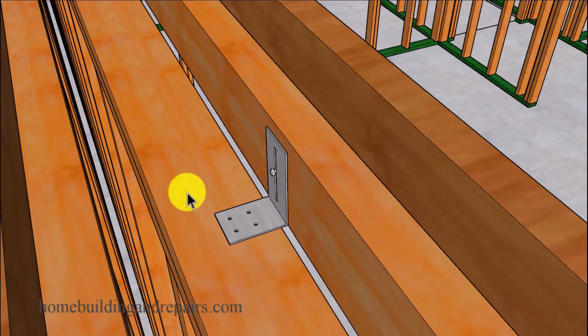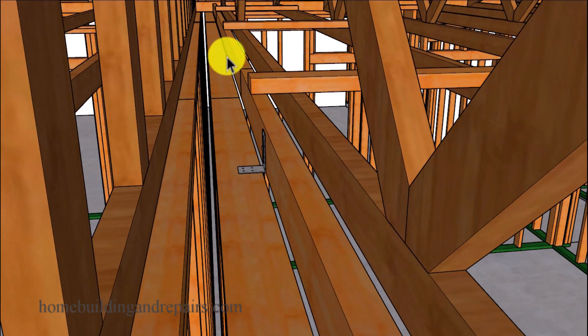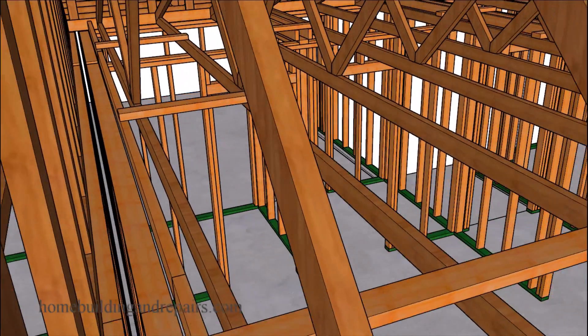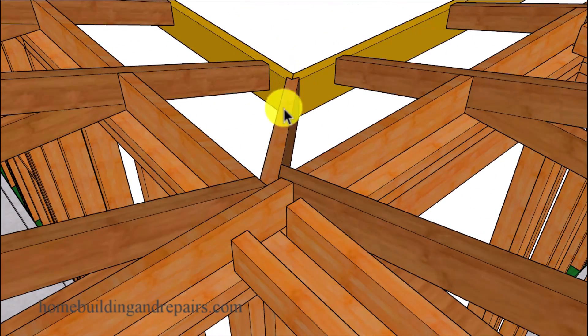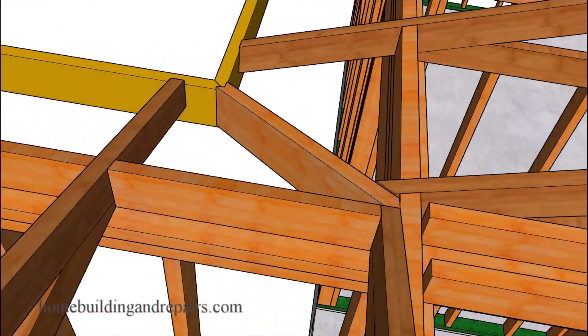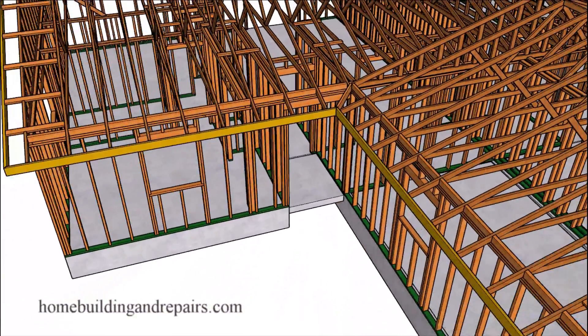Even though this is going to be a full height wall, you might need building hardware to connect the wall to the trusses, spaced about 32 inches on center on both sides. Over here we're going to have the gable roof truss, and we can probably get away with just connecting the 2x4 to the truss on this side. I do have other videos if you're looking for more information about truss backing, ridge blocks, and building houses with engineered roof trusses. You will also need some type of board here to connect the break for the roof sheathing — this would be a false valley extension.